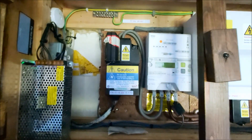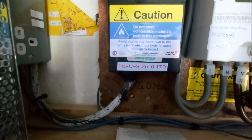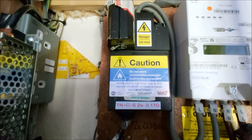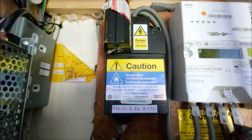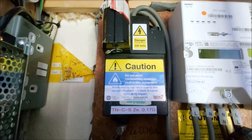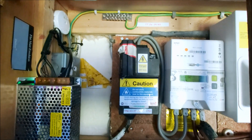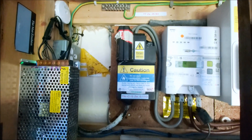This is our incoming electrical supply — that's the incoming cable that goes into the service head. It's a two-core cable: a core in the middle surrounded by an armour. This comes into the house, and with pretty much all new supplies, the earth conductor is effectively neutral. It splits at the service head to give you a neutral and an earth conductor, but in effect it comes from the neutral, so the incoming part is the PEN conductor.